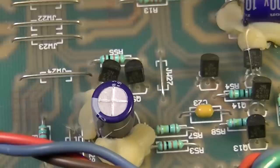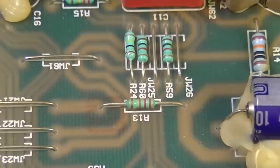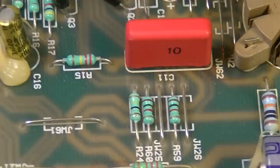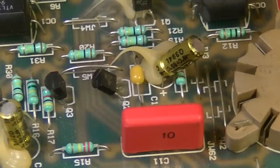This is a single-sided board. There are no pads on this side of the board, so you can only service this thing if you have to change parts. You can do it in one of two ways. You can either clip the part out and J-hook on the new parts on the top, or you can pull the whole board out of this thing.